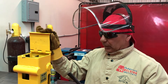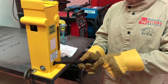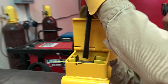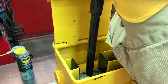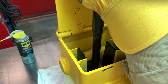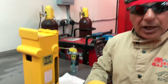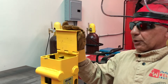So let's say we're all done testing our welders. We're going to open the relief valve by turning it counterclockwise about a turn — we don't want to overdo it as it might thread out of its place. We're going to open the lid with the right hand, and with the pump handle push down on the piston and push the ram down until it seats all the way. It is not hard to push, but it does have to be manually pushed down until it bottoms out. Once it's bottomed out, close the relief valve to ensure no fluid leaks out — close it tight, snug, but not excessively tight. Now we can put away the pump handle inside where we retrieved it earlier.